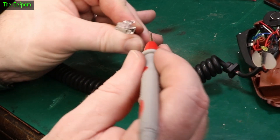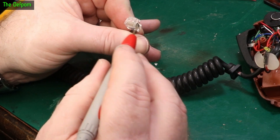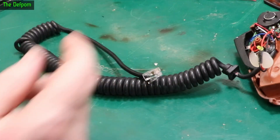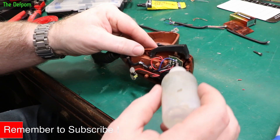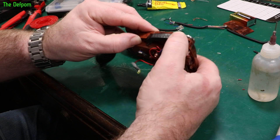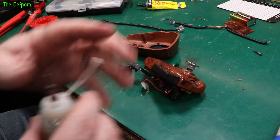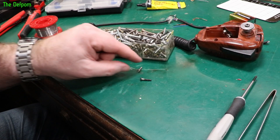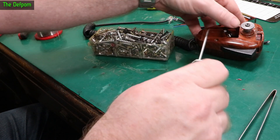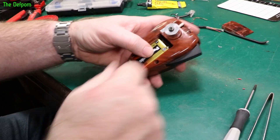So I attached a bunch of wires it didn't actually need to use. If you want, put a little bit of cleaner inside the switch while it's apart — give it a clean with IPA, then some switch cleaner as a lubricant just to make sure the switch is in good condition because they do get dirty. From my collection of screws I've managed to find a couple that are similar enough, so I'm going to replace the remaining screw with a matching pair.